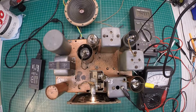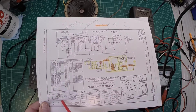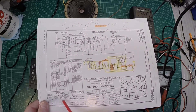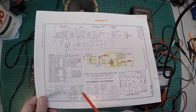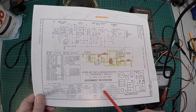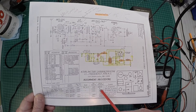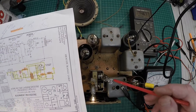I think I'll let that be. Let me look at the directions here one more time. Making some changes here — the signal generator is called out for step number two. I'll be going over to the antenna lead itself. I need to reset my oscillator here to 1500. Then we'll adjust trimmer number F, which should be right here.